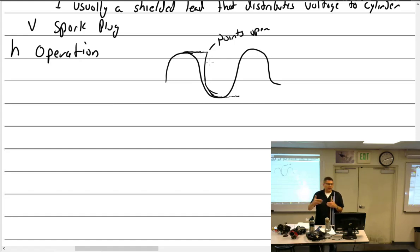Follow me so far? Mm-hmm. Okay, and where did we get the voltage in the primary? From where? The magnetic lines of flux cut across it. Therefore, we have a magnet going across wire, which induced a voltage and current flow. All right, so now we've got this current flow going through the wires. Well, what does that do? It creates a magnetic field that helps the magnetic field from the magnet or hurts it. So to speak, it hurts it. It opposes it. So it sets up its own magnetic field that wants to fight it.